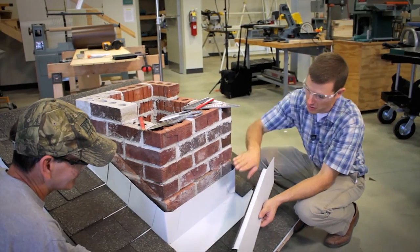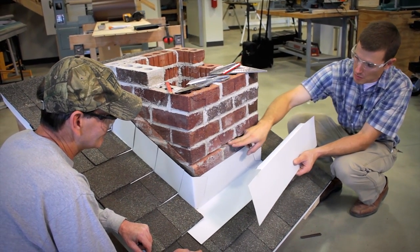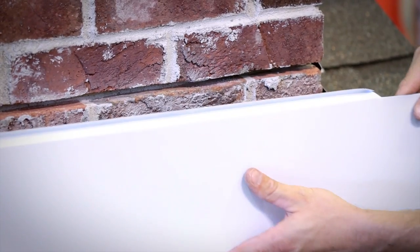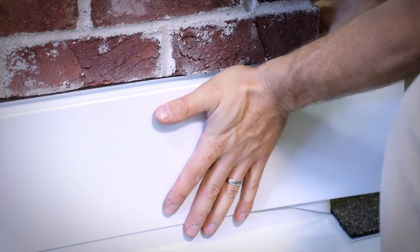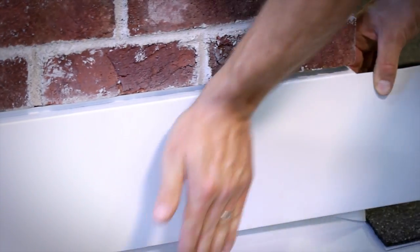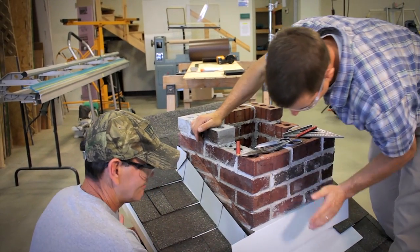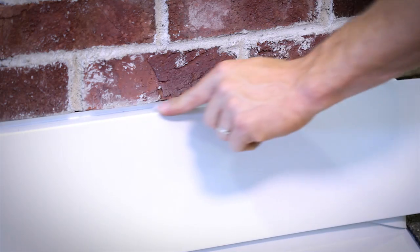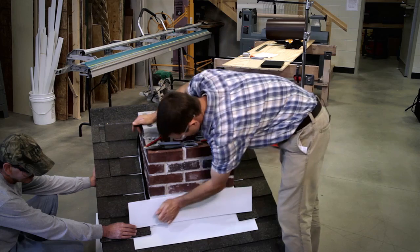For the sake of the video we're going to tear this apart — I'm not going to put sealant in here — but at this point I would go ahead and put a heavy bead of sealant in the joint, take my flashing up inside the joint, and push it into that sealant. Normally just a light tap with the palm of your hand gets this set in good and tight. The masonry has a little variation, but this one-inch return on the top accounts for that.